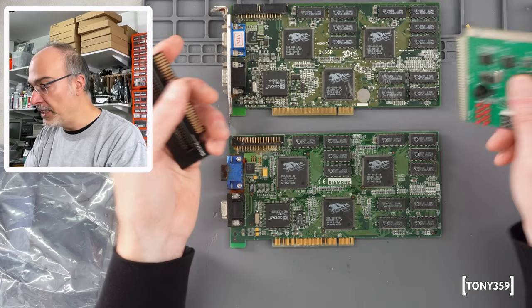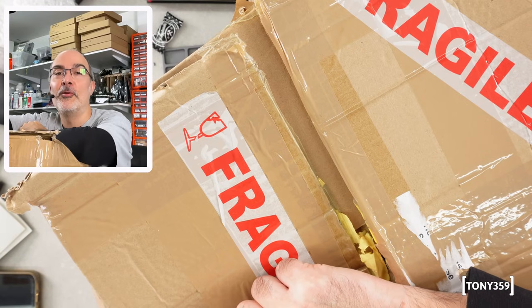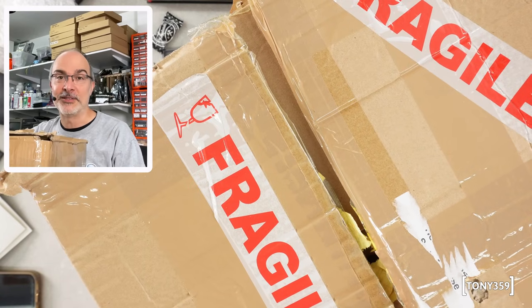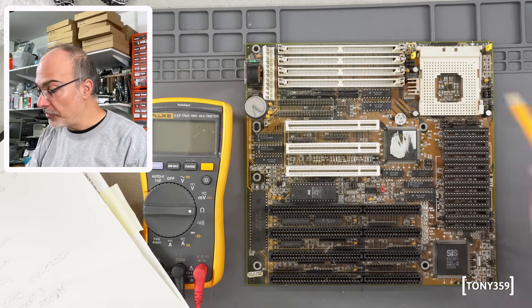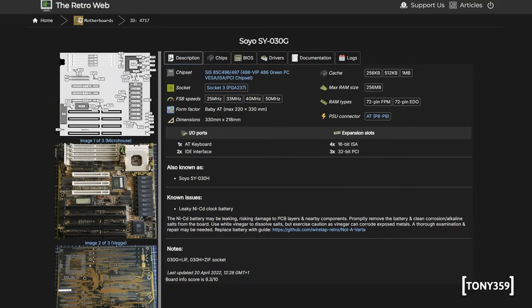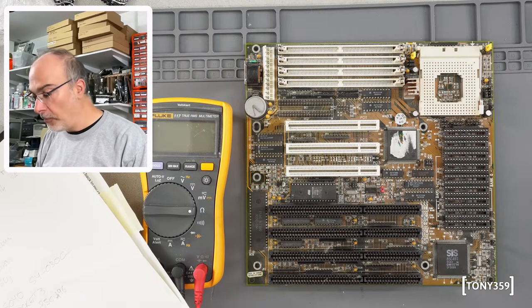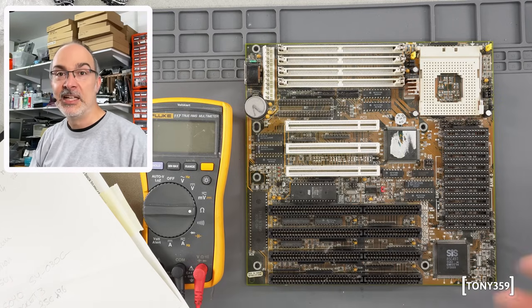Now let's move to something which is for me this time — a donation from one of my patrons, Pavel, from France. The box is too big for my desk. We've got a motherboard — it's a Socket 3 motherboard for 486 CPUs, a Soyo SY-030G with the sticker peeled off. I understand these worked totally fine until one day a screw ended up around the north bridge and since then the board was dead. Let me first double check we don't have stupid voltages at the CPU VCC, and then I'll give it a quick go.